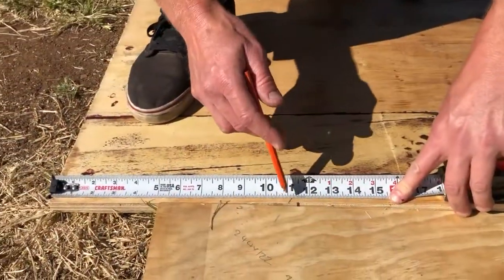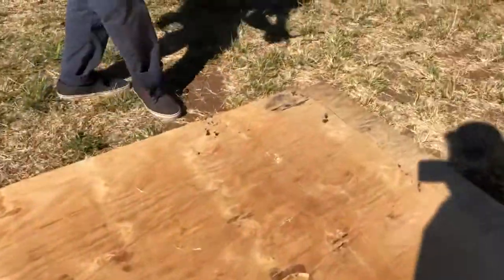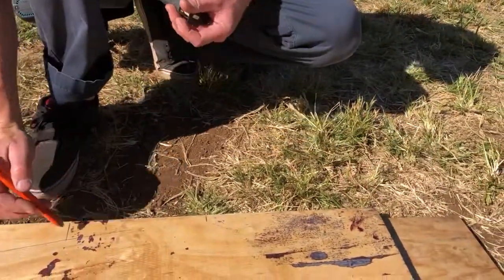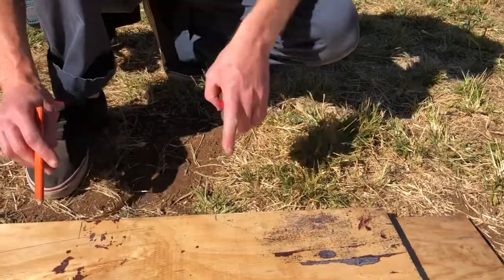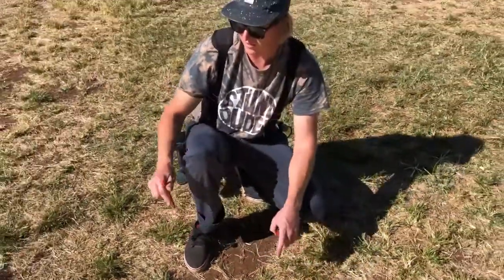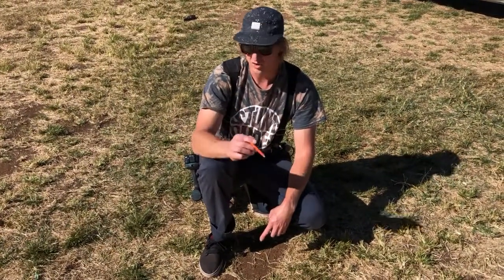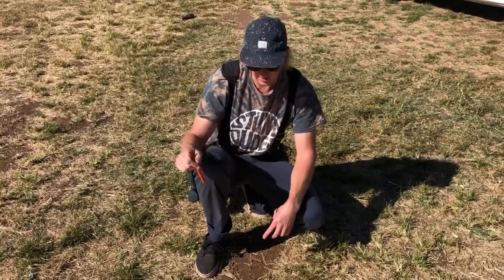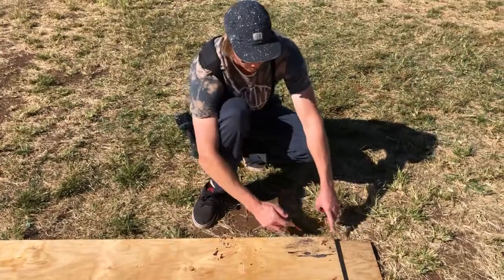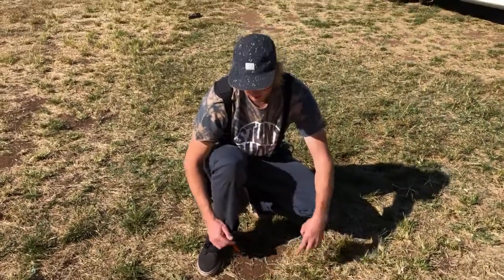The way this laid out, it gave us 11 inches of straight here. Because I'm trying to get 2 pieces out of this, I want to make sure that we have 11 inches here. And as you see, we have plenty of room for our template to get 2 pieces out of this. It doesn't matter if this is 11 inches or 9 inches. For a 4 foot quarter pipe at an 8 foot radius, you can only do about 12 inches maximum on the top. But it doesn't really matter where that is. It just depends on how much deck space you want on your template.